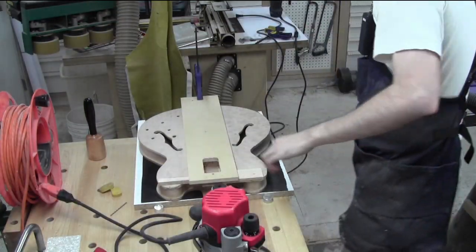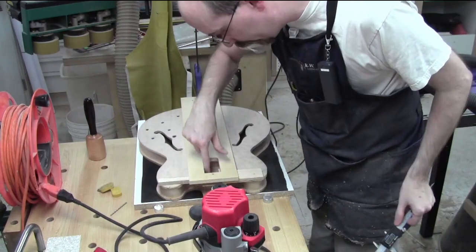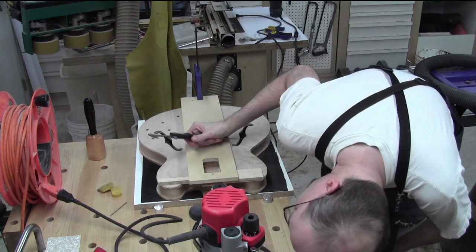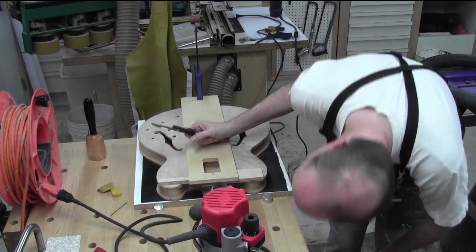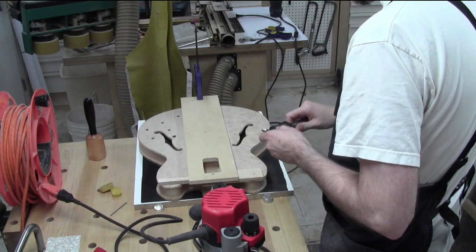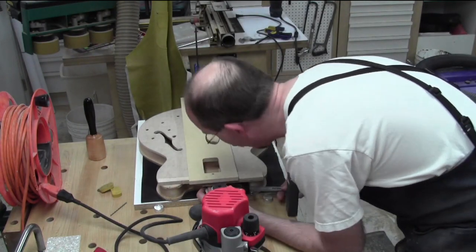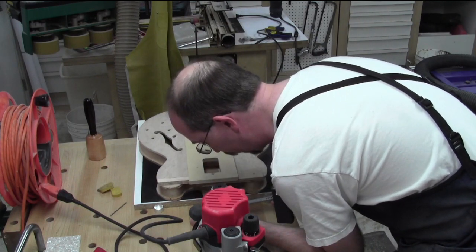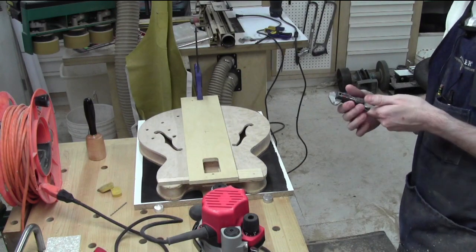I've cut looks like about 3/4 of an inch depth so far. I'm just getting in here to check, make sure everything's where it needs to be. We're about level with the pickup pocket, and then we are centering pretty decently. That's good. I want to just make sure I've got enough lumber laying around here. I'm also curious how wide our slot is here. About a little under 1.5 inches, which is what I wanted. We're, in fact, 30 or so thou undersized, which is what I was after.